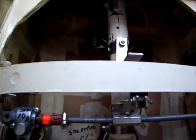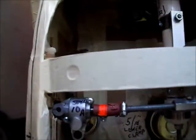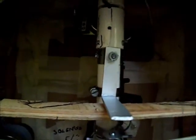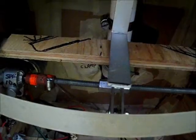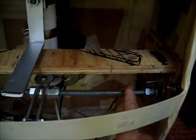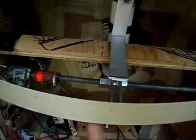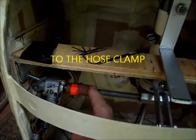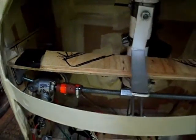So I'm making this video in case he watches it and it gives him some ideas. He doesn't really have to do all this stuff. He's doing all this on his own, and I sure do appreciate it. The rod that I have here, from this point here to here, and going into the bushing that I got inside there, is 11 inches exactly. I had to cut 1 inch off. And when this is thrown over, it only goes to about here anyway, so a shorter rod would probably work. When this is swung over to here, it comes right to this bushing here, which is about 3/4 of an inch inside this rubber coupling that I got here.